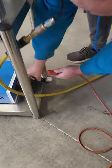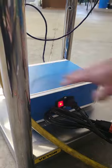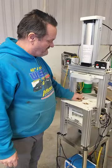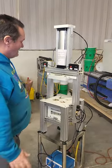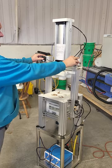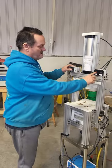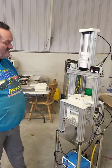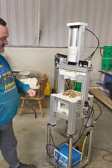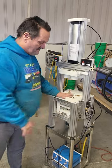Plug your power into your power cord and turn the power switch on the back of the control box. Now you're ready to go. Make sure to remove the paper filling out of the holes that are protecting the mold. Push the safety button down and hit the start button — it will come down and press, then extract. Hit your reset button and it will go back. That is your setup process.